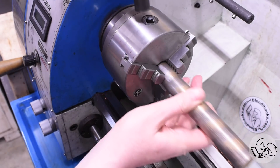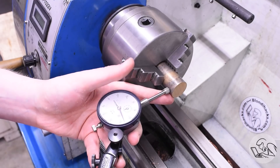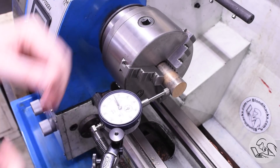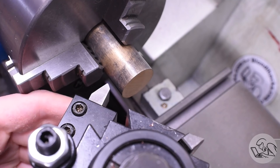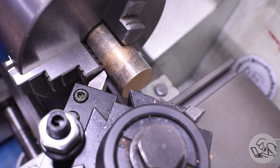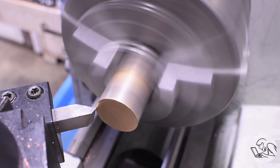I'm going to start by making the two steam valve bushings at the top, so I'll chuck up the material in the three jaw. These bushings are basically a bunch of turning-to-a-shoulder operations, so I've got an 85-degree tool here for cutting inside shoulders, and it's easy to line it up using the chuck jaw and the stock.